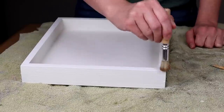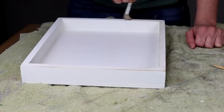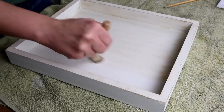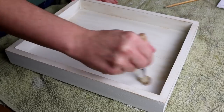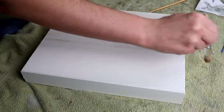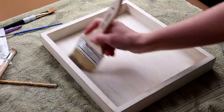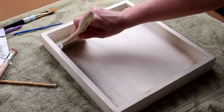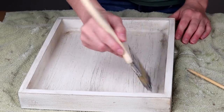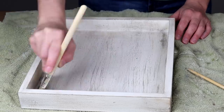Once that paint was completely dry I took my Dollar Tree stencil brush and my hazelnut colored chalk paint from Waverly and dry brushed that on top of the entire piece. On the flat longer sides the front and back I did all of my brush strokes going in the same direction. I'm painting the entire piece because I'm going to be doing two projects — one on the front and one on the back. After the hazelnut color I'm also adding my paint in the color castle using a large chip brush to dry brush that over all the same spots, and then to add a little bit more dimension I'm dry brushing chalk paint in the color ink over the whole piece as well.